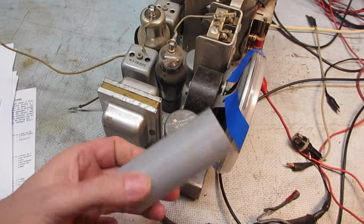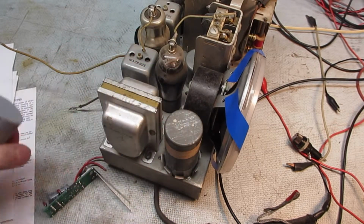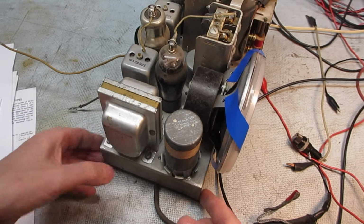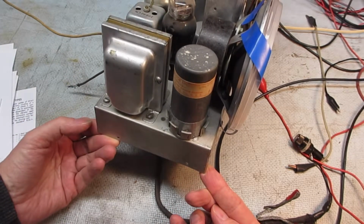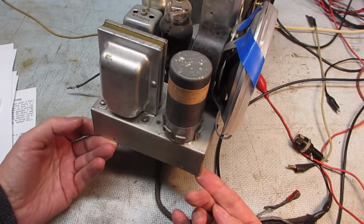And then hopefully I won't have that little extra bit of noise, electrical and audio, from the vibrator, and I won't have the starting problems, not to mention the fact that good luck finding more of these vibrators. I guess there might be somebody that's actually making replacement vibrators. I don't know. I think they're solid state. I don't think they're actual mechanical ones. Or at least I think I've seen them on the internet.